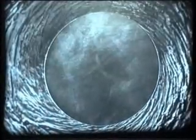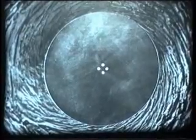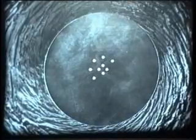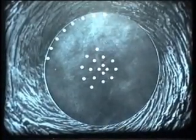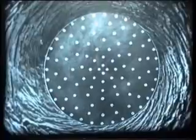Here in diagram we can see the pattern of shot holes. First, the center core of 4 holes working outwards. And from 32 perimeter holes we work inwards until we have a final pattern of 7 concentric rings. As each hole is drilled out, the machine is withdrawn and the hole is plugged with a wooden peg to mark it.